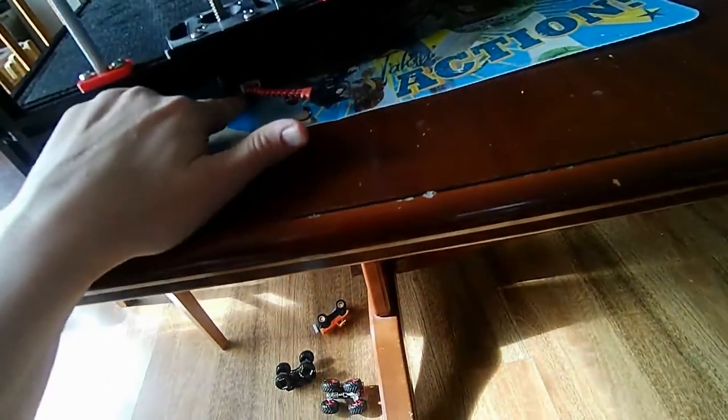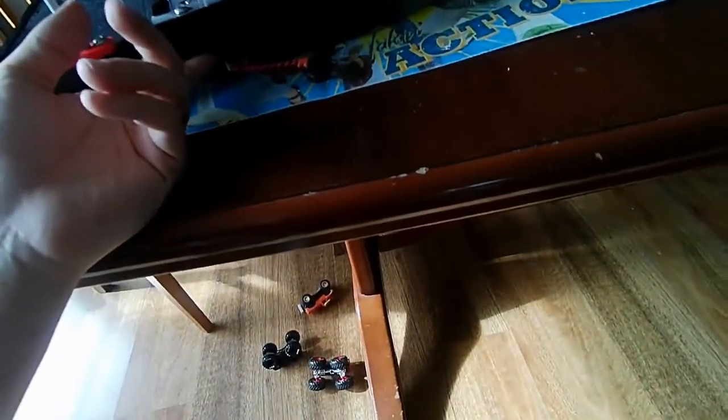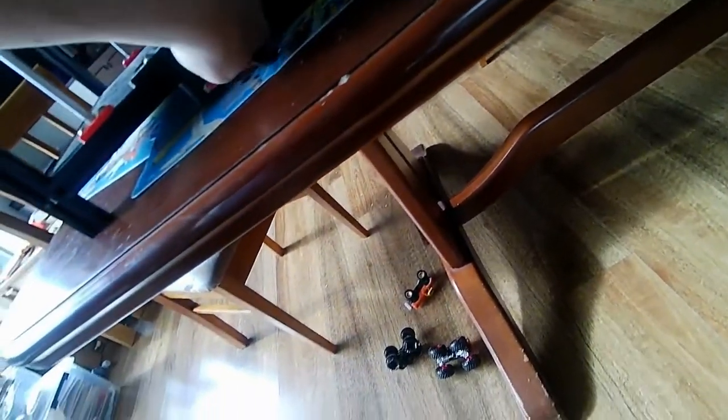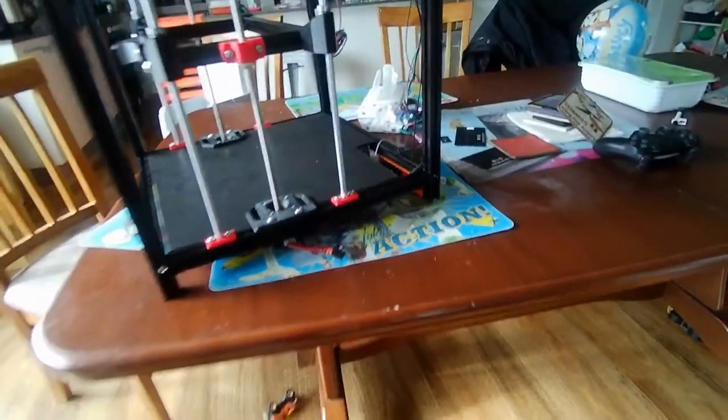What I've also learned is that the CAD has these bits stepping out, which looks like it's possible until you realize that the skirts are going to go here. So it's not possible at all. What you should be doing is put your motors facing backwards or on the inside. I think inside would definitely be okay, like going that way. And that means you've got more room for them to go into your rear enclosure there.